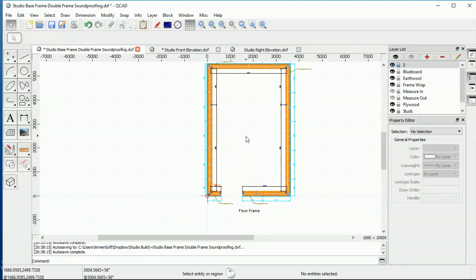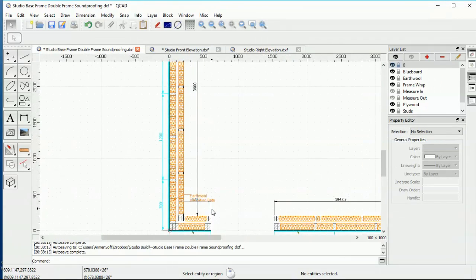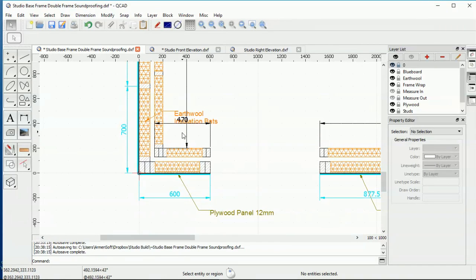That's the whole plan. After much research, I discovered that the most effective option is what they call a room in a room. So I have my outside timber framing and wall, then with a small gap, in my case about 40 millimeters, I am building another frame and wall inside it. This way, both walls having insulation will minimize any noise transfer and give the highest noise isolation.